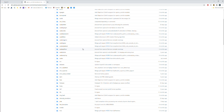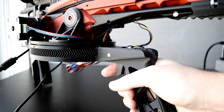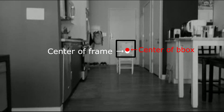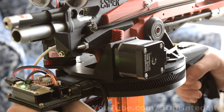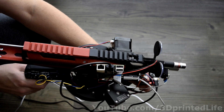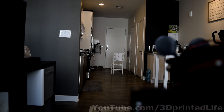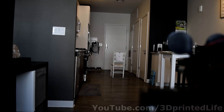OpenCV time. OpenCV has a ton of built-in algorithms already — basically just finding the ones I need and making them work, which is the hardest part. In normal operation mode, if you half-press the trigger, it will take whatever's in center frame — what the laser is aiming at — and start tracking that. It feeds the centroid of the tracked object's position back through the algorithm, and if the object is no longer centered, it tells the motors to move so it's aiming at it again. Let's test it: aiming at the center using the laser, half-press the trigger, and no matter how much I wiggle or close my eyes, the Nerf gun stays aimed right at the target. Fully pull the trigger and it fires.